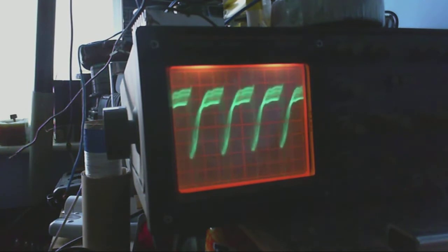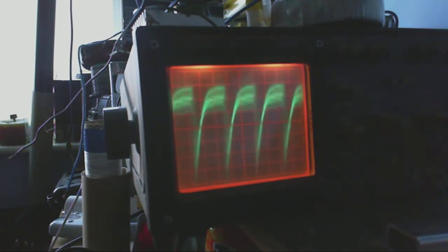Okay, well, I thought I would do a little bit of debugging to see if this thing is actually working, so I've got it connected up to my oscilloscope. Here you see the circuit, and here is the output on the scope. Seems to be a very strange waveform, but I've got it connected up to my microphone preamp, which is why you're hearing from the webcam's own microphone at the moment, and as you can see, as I speak, it does modulate the waveform. So, it is working, only trouble is, I cannot seem to tune this in on any radio. Maybe if I was to connect some kind of RF amplifier to the output of this thing, then it would be a completely different story.